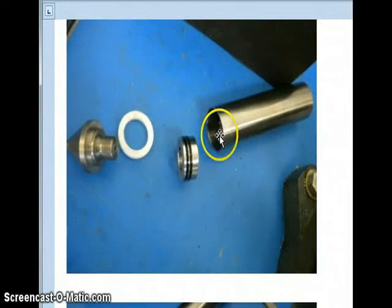Inside the bottom of the sleeve there's a retaining ring with two O-rings. We do recommend changing that with every second or third sleeve change. They tend to get a little out of round after hundreds of feet of pushing. If you have any trouble with the sleeve operation, always try a new sleeve and a new retaining ring before assuming the cone itself is bad.